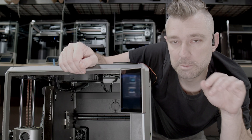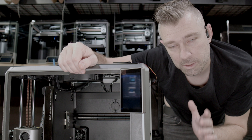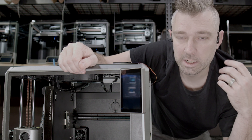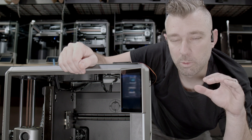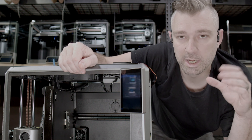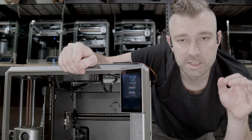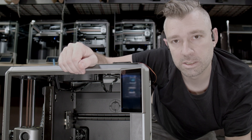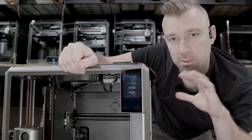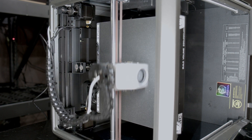Now that we have the belt tensioner loosened, we can move on to the next step. In Creality's after-sales YouTube video, what they have you do is move the bed all the way to the bottom and put the shipping screws in, then pull the belt off and put it back on. We're not going to do that because there's no absolute position — it doesn't get the Z screws properly aligned. Earlier we made sure that we homed our printer and left it. Now we're going to turn the printer back on and start meshing the bed. This will give us an idea of how off-level our bed is and how out of alignment our Z screws are.